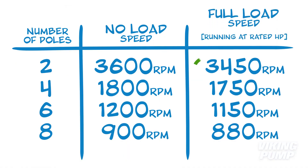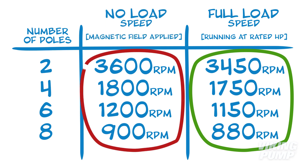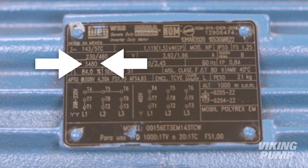So far we've been talking about speeds when the motor is unloaded. In reality, motors are typically powering equipment at or nearly at their rated horsepower. Running at rated horsepower, the motor is at a point known as full load. Under full load, there is a difference between the motor speed and the magnetic field applied — this difference is known as motor slip. Full load speed is always lower than unloaded speed, but can range from design to design. The motor nameplate speed will be the full load value for the motor.